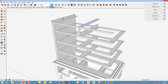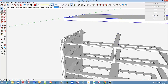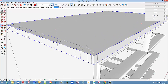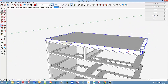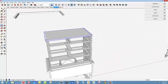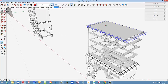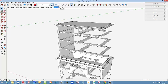Stage ten brings in the dovetailed top piece and the cornice molding. These dovetail connections really provide a lot of strength and rigidity to the carcass structure. The sides and the top are one inch thick, which also makes for a very strong case. The cornice is best located from the rear of the structure — I will bring it down and connect precisely there. Now it is obvious I am missing the right side of the case, so we can copy that side after the back.